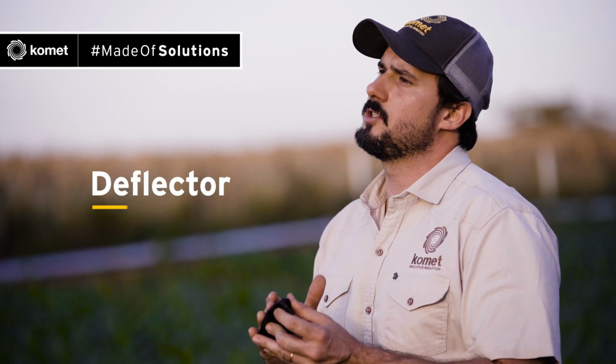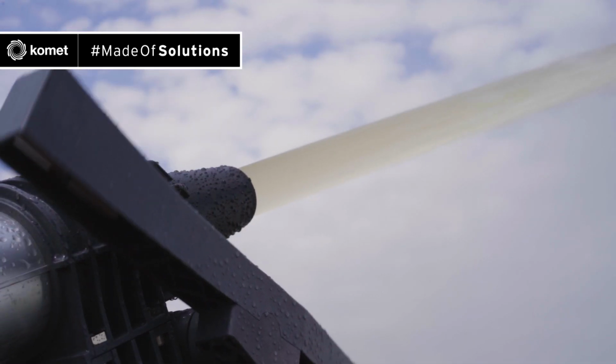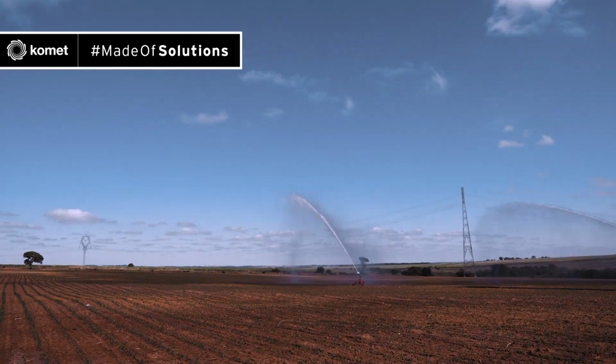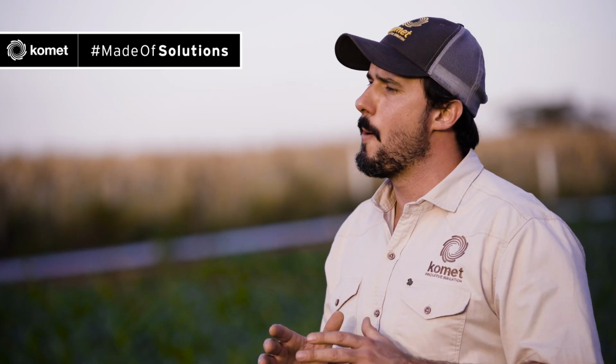The deflector is the second essential part to achieve uniform water distribution. It is highly engineered and distributes the water from the gun throughout the entire throw radius. The throw determines the area being irrigated and can reduce the instantaneous water application by distributing the water over a bigger area.